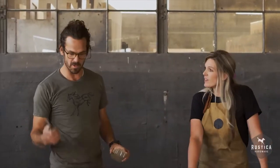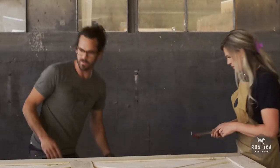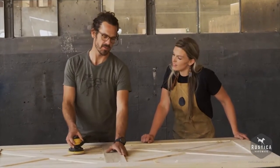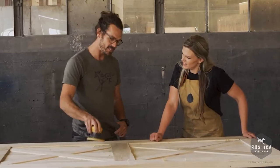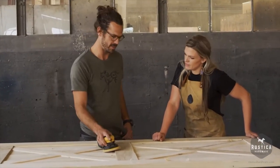Okay, this looks pretty good. We got wood chips everywhere. This is telling the story that we want to tell. We got the wormholes, cougar scratches, cracks, grandpa's boot, water damage - everything. So now we've got to sand this because we don't want to leave it as is. There's a lot of areas where you can get slivers and it's just not smooth to the touch, so now we want to ease it over with sanding. When sanding the door, there are a few things we want to do - there are a lot of sharp edges and corners on the stile and rail, and we want to ease those over as well as the large distressing marks so you can run your hand over the whole thing without getting a sliver.